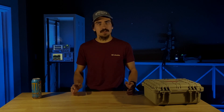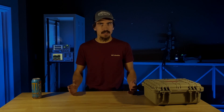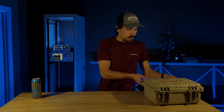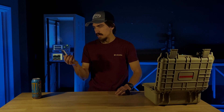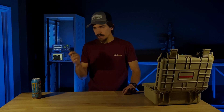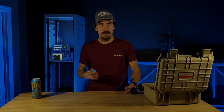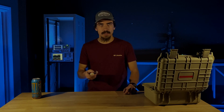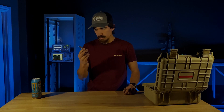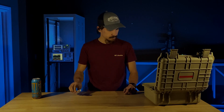One of the best ways to listen to radio frequency transmissions has been with a software-defined radio, and the easiest and cheapest way to get into SDRs has been the RTL SDR dongle. This neat little USB dongle has a maximum frequency range of 1.7 gigahertz and a maximum stable bandwidth of 2.4 megahertz. It's very nice, and if you want to get into radios, communications, and situational awareness, you should absolutely pick one up.